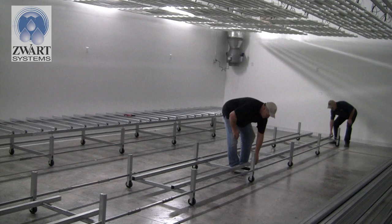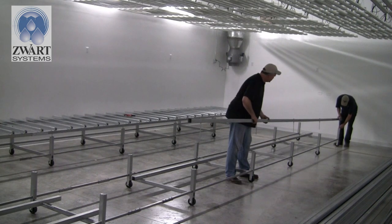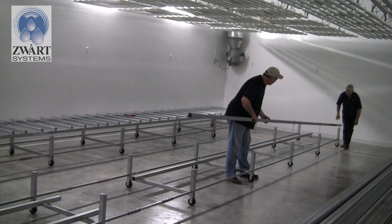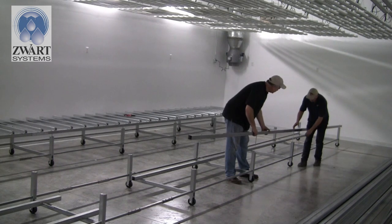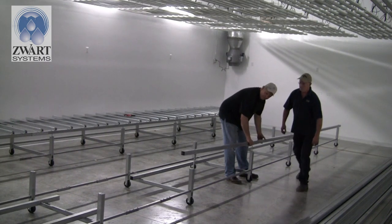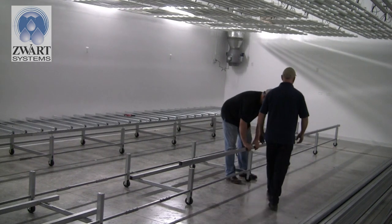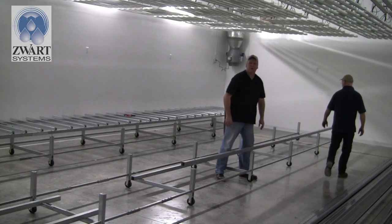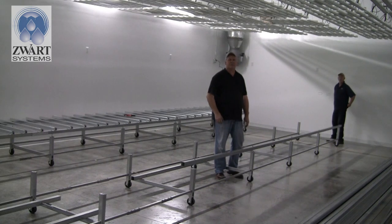The two-by-two has been laying on the stands. We've put in the threaded rod to the right height and locked on the top. This is a two-man job — one person helps set the two-by-two up on top, starting on the inside and working along. Then we have the splices to put in on the two-by-two and then we'll be done.